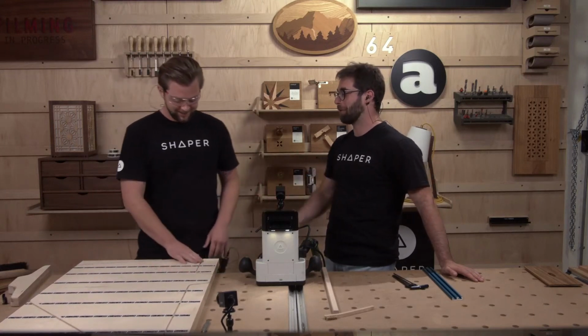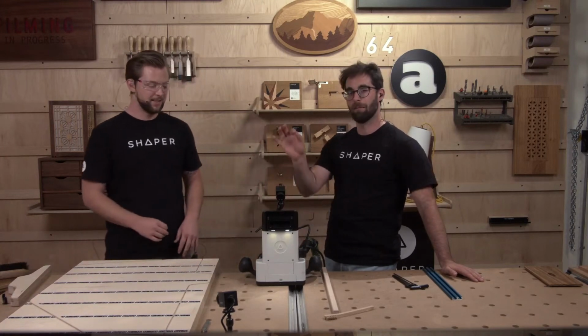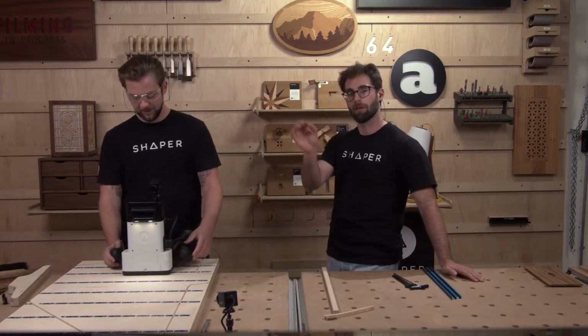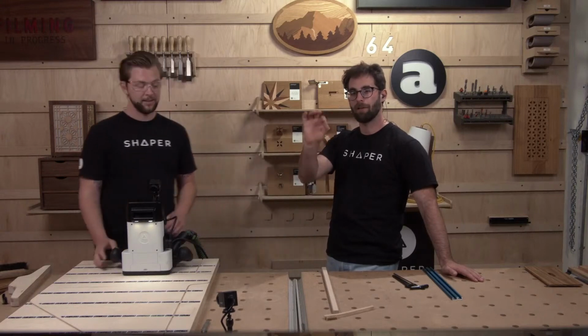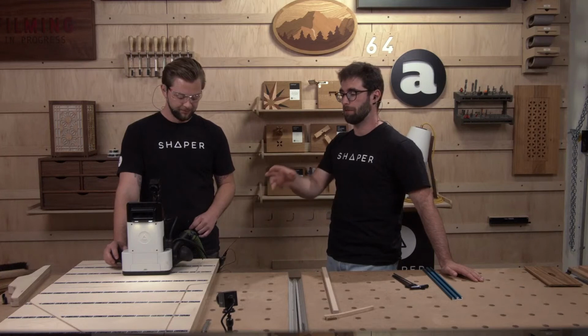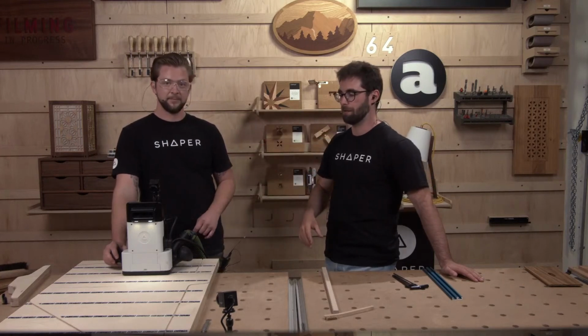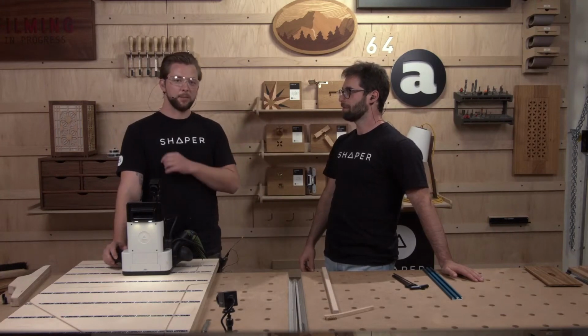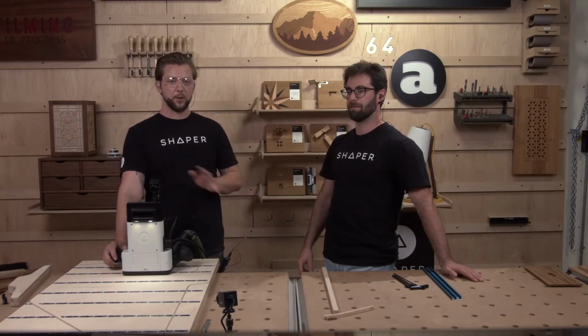And to add one thing to that, I don't like to have to remember personally, so I would just mark that corner with a pencil. Like, put an O there, O for origin. This is my 0 point, or you could do like math grid style 0, 0 right there. That way you don't get confused. You could flip it the other way and still keep track. Big fans of putting marks all over your piece, because you're going to sand it anyways.